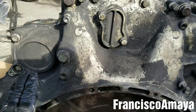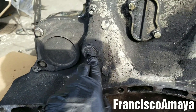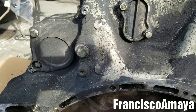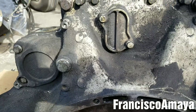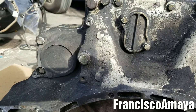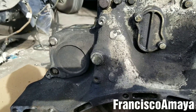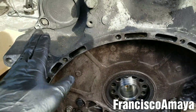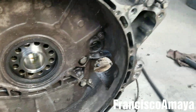All the bolts are completely tight. While torquing I noticed the bolts were getting very tight at 144 ft-lbs as some specifications suggest, so I ended up giving them 90 ft-lbs, which is normal for these bolts. I'm not sure why Detroit has two different specifications in two different bulletins, but 90 ft-lbs is what I went with.